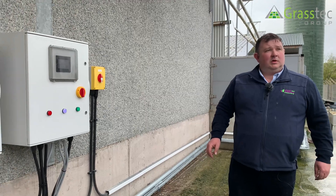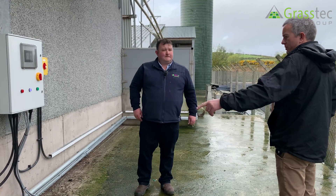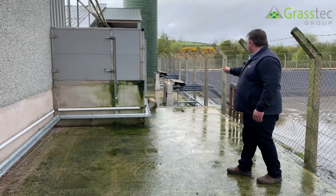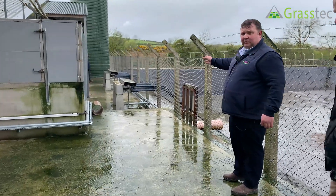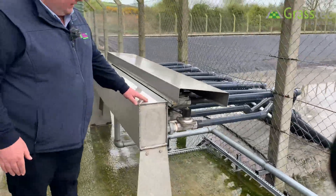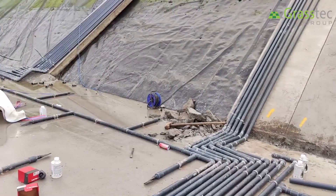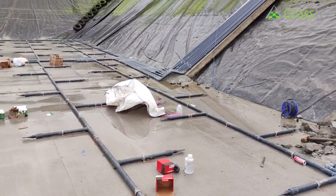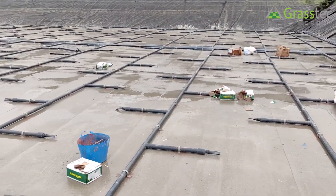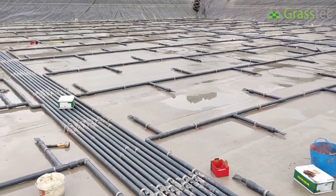Can you remote in and manage it remotely? You can, if need be — the PLC allows you to do that. So the air is being pushed out around the system. We work with galvanized pipe running across to the manifold. On this stainless steel manifold, we work with stainless steel solenoid valves which open to run one circuit. Basically one circuit covers about 20 square meters in the lagoon, and then sequentially once it stops one section it moves on to the next, and so on, moving its way around until it's finished.